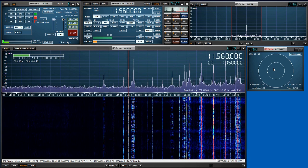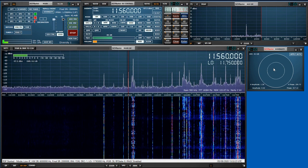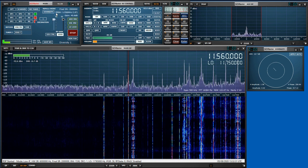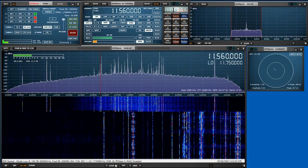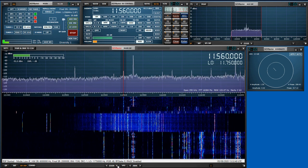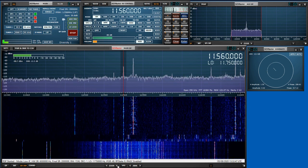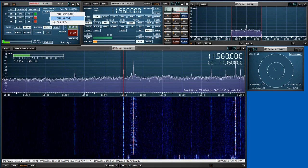You can see right now we're getting a signal-to-noise ratio that pops up and down, but it gets as high as 20 dB. If I get rid of the diversity tuning — I won't say it's pure noise, but it sure is a lot of noise. We're getting a copyable signal here, but really not that good. We'll go back to diversity reception.